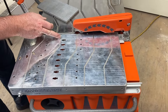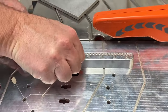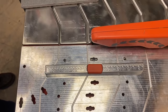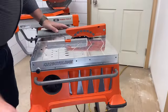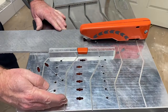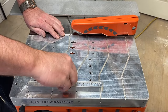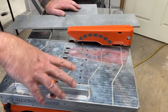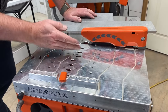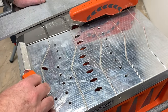The other holes are all in one inch increments off of the blade. So let's say you want to strip out some two inch material — drop this right there at the two inch, and now you're set. You can drop that in and actually lock the table. If you want to rip something large, you're just feeding it in and ripping things down, and that goes up to eight inches from the blade. We're also going to have additional fences for cutting miter cuts that pop into these holes, and one with a micro adjustment so you can cut two and a half or three and a quarter inches precisely.